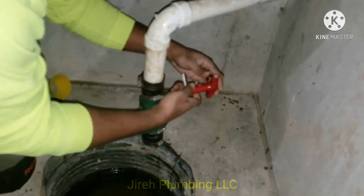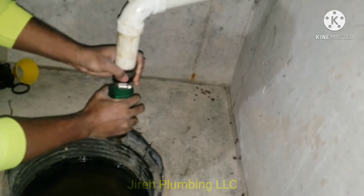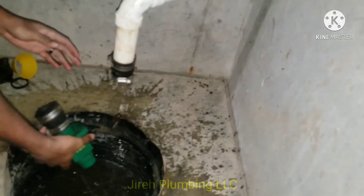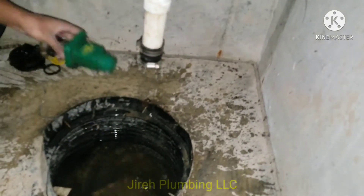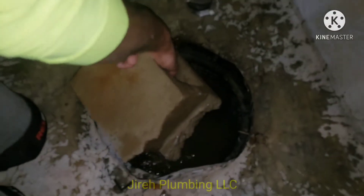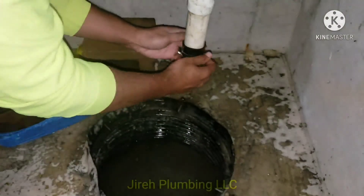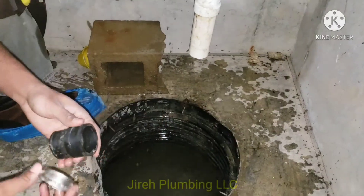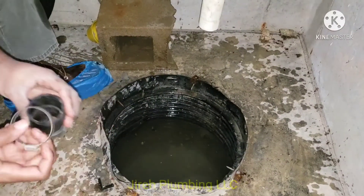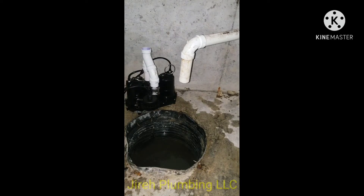Remember, pull the pump out carefully — you don't want to be splashed with water. What you see me pulling out here is a cinder block. Normally what you'll have is a brick about two to four inches tall to give the pump enough height off the ground so that sediment from groundwater and rainwater does not block up the pump.